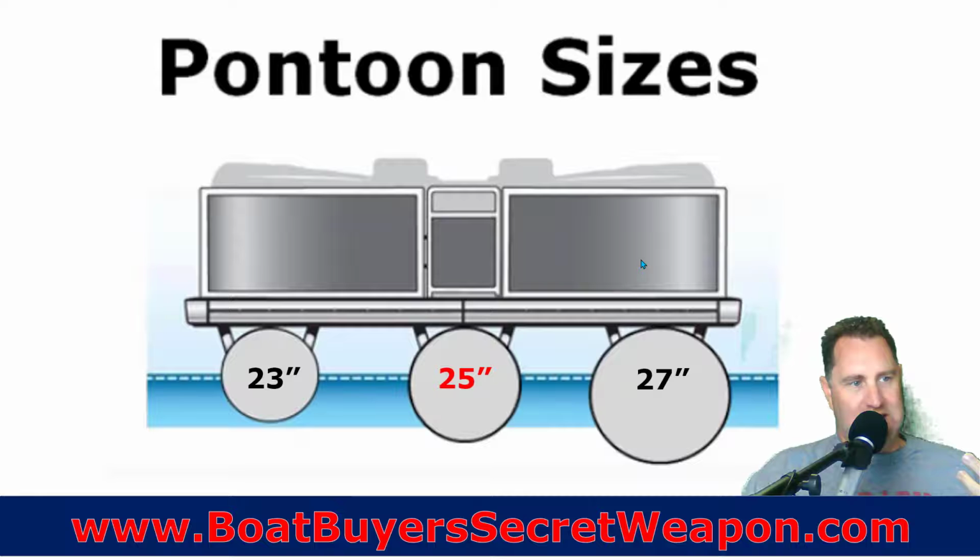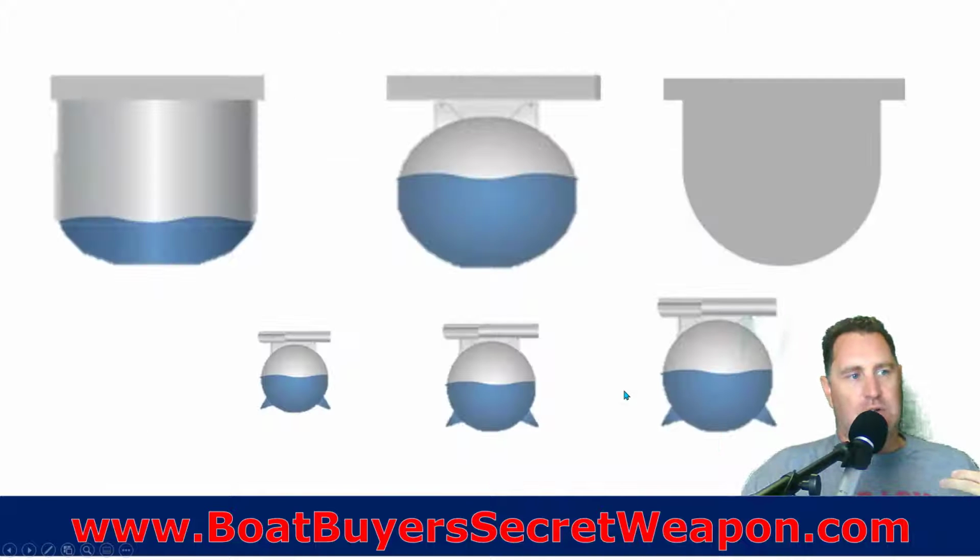The size of the tube is going to make a difference. In the older days, they used to do 23, and 25 is pretty standard. Now you're seeing some 27, and you're also seeing some different shapes. You've got JC with their U-shaped tube, and they say, hey, this makes it easier to mount the flooring and the bracing. If we can mount it straight to the tube, it's more structurally supported. That's their style. You've got some that say, hey, we're going to use a different shape on the center tube. Bennington has an elliptical tube. You can see it's kind of an oval that gives you a little bit more surface area and more buoyancy.